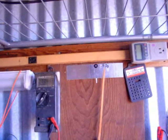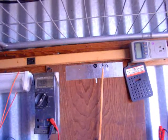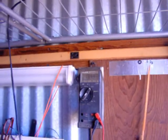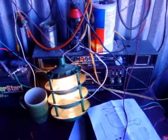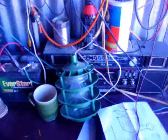It looks like we're kicking something in — about 2 amps going in, 24 watts. Not too bad right now; I like it when it does 8 amps, that's much better. Reading 13.44. I'm going to leave the camera on — there we go, 13.8. The charge controller kicked and diverted the load from the battery for five seconds.